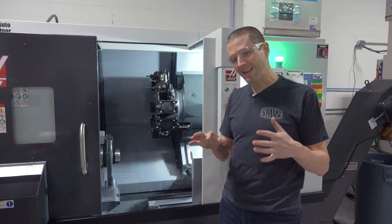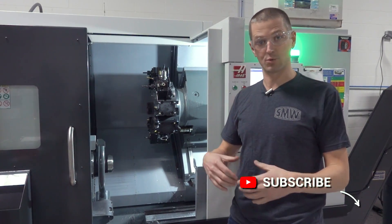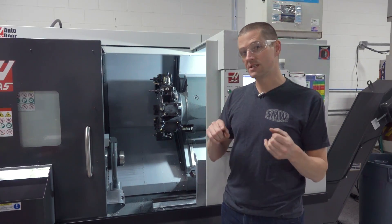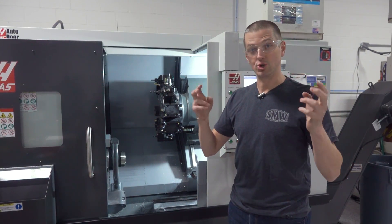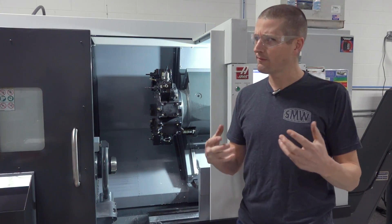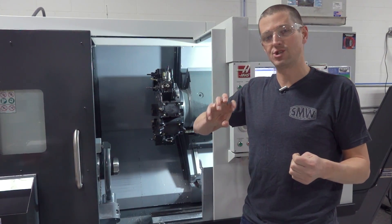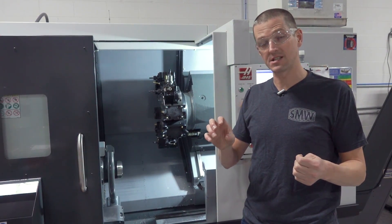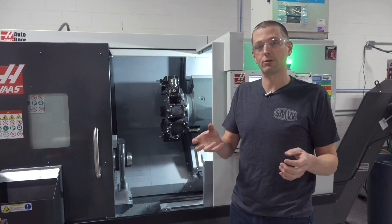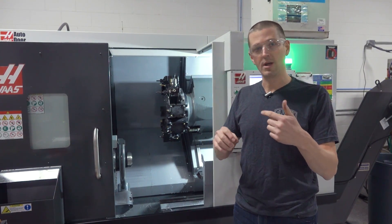The finishing spindle option is relatively new — click subscribe and we'll be sure to cover that in future videos once we've actually started using it. The difference between it and a proper dual spindle or DS lathe is that this is just a finishing spindle, so it's not as powerful, but for what we need it should be fine. The limitation is you cannot do interpolated simultaneous fourth axis work, but you can still do positional work — so we can rotate a part to a certain orientation and then use our live tools to drill, tap, machine, etc.